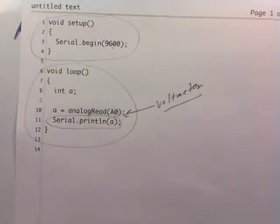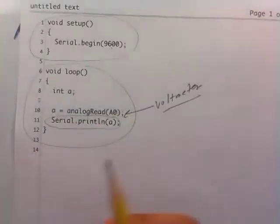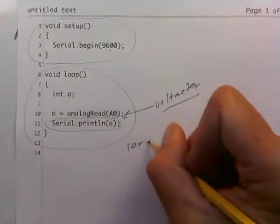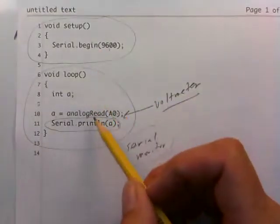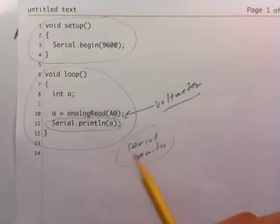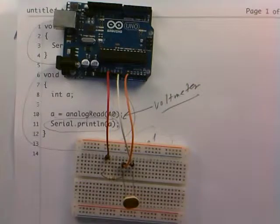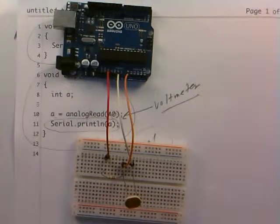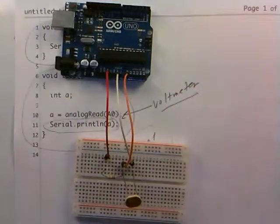If you run this code on the Arduino, build the circuit like this, turn it on and run it — and you have to find a little tab in your software called the serial monitor — open up the serial monitor and all communication on the serial port will be displayed to you. You'll see a bunch of numbers scrolling on the screen: those are the analogRead values the Arduino is measuring. Wave your hand over the photoresistor, change the room lights, or cover the photoresistor, and you'll see those numbers change. What you've built is an Arduino circuit interfaced to the computer — essentially the computer, Arduino, and circuit are now one big happy family: an electronic circuit that can sense light levels.